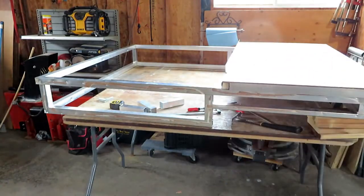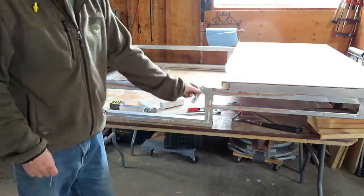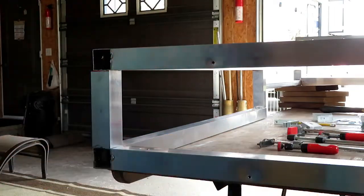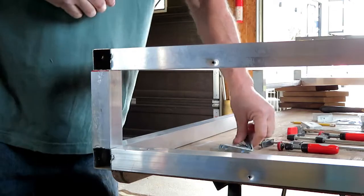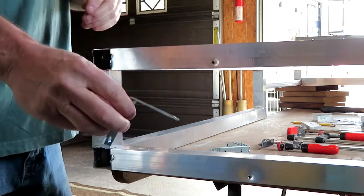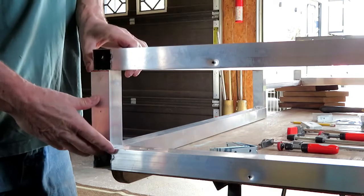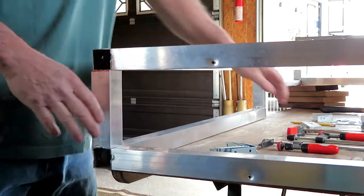On the inside you won't see it. On the corners I can put two — one on either side — and then on these parts I'll put an angle bracket and then a flat bracket on the inside. What I decided to do initially is put some L-brackets on the inner corners: clamp them together, square it off, and put some L-brackets with some self-tapping screws in there.